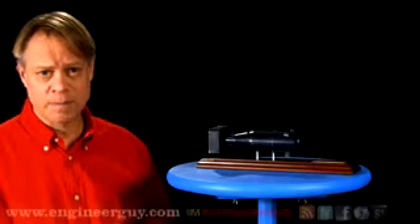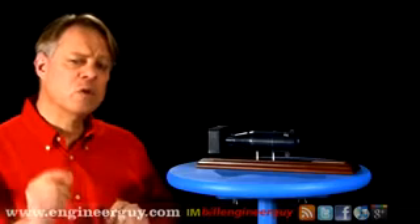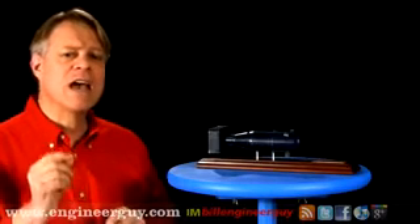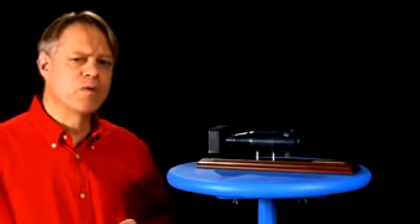How do we go about enriching the U-235 in natural uranium? When we separate two items, we make use of their differences. The two major uranium isotopes have identical magnetic and chemical properties — no magnet will tug on one more than the other, no solvent will wash away only one isotope, and neither will boil before the other. So to separate them, engineers exploit the one small difference between them: U-235 weighs slightly less than U-238, less than a 2% difference — just enough to make separation possible, but not easy.